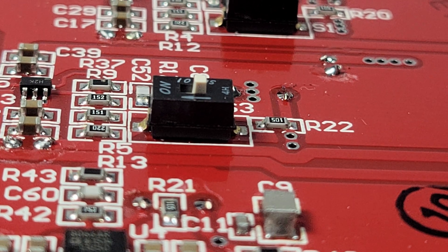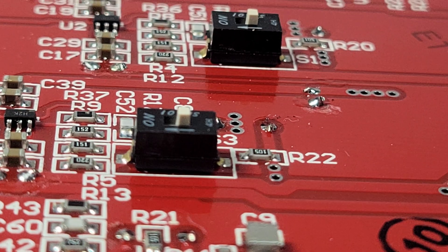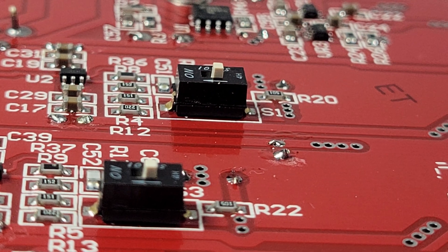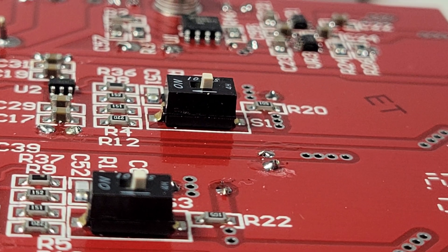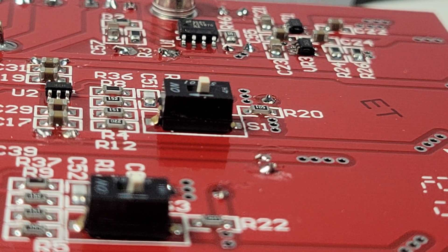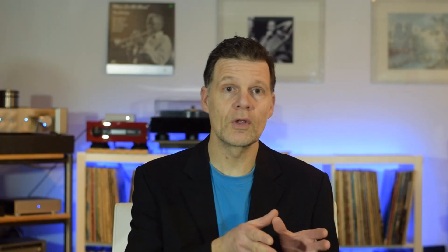You flip the board around and on the bottom you'll see the op amps — 8066AR and LM49870s — those are the amplification and they're also involved in the RIAA equalization curves for the phono stage. There are also several DIP switches. The Mani has moving magnet and moving coil capability. There are three levels of gain selectable with two sets of DIP switches: 30 dB, 48, and 59 dB of gain. There's also variable loading — 47K ohms for moving magnet and moving iron cartridges, and a 47 ohm option for moving coil cartridges.